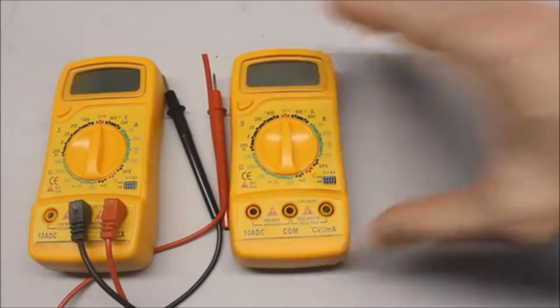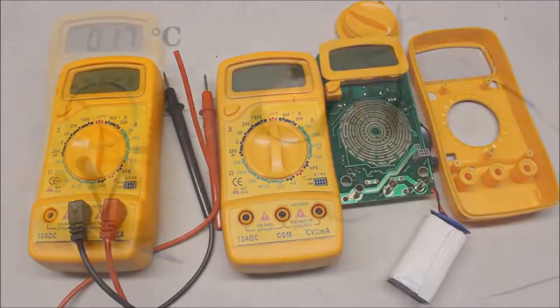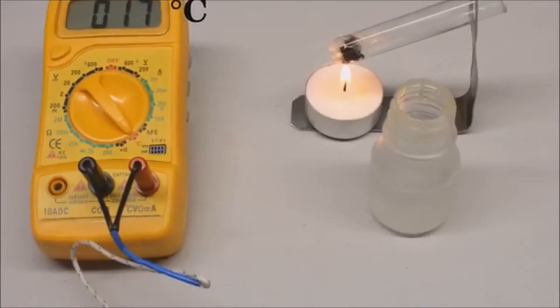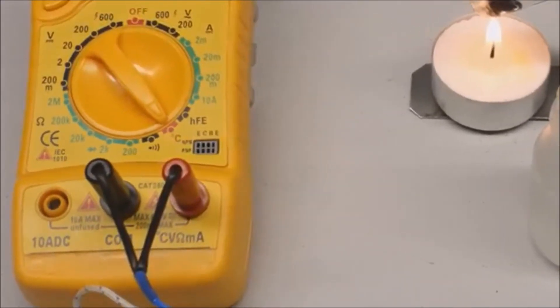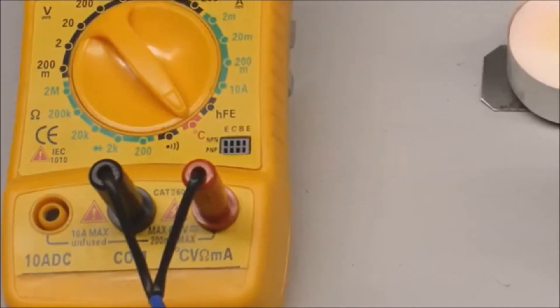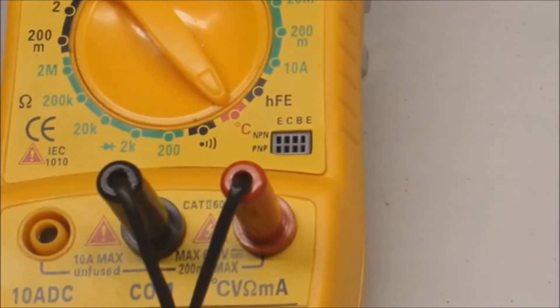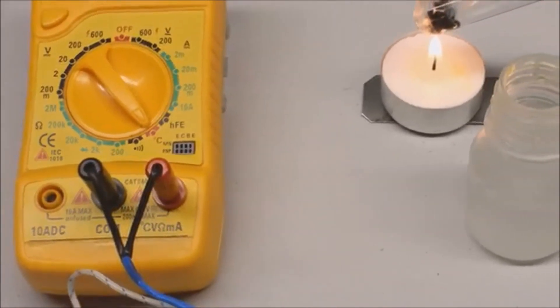So it is wise to spend some more money and buy an instrument of good build quality — buying a cheap one and another cheap one creates a pile of rubbish over time. The main functions of digital multimeters are resistance, voltage and current measurements. Another feature is temperature measurement — the test leads have to be replaced by a thermocouple and the rotary switch set to the temperature function. According to the instruction manual, the multimeter is capable of detecting temperatures ranging from minus 20 to plus 1000 degrees Celsius.